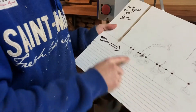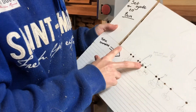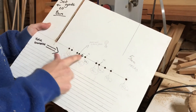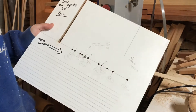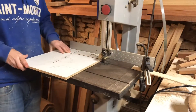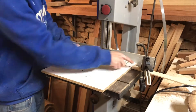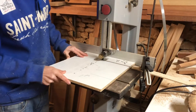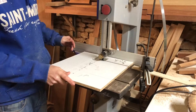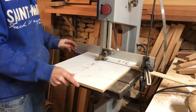Here's the board I was telling you about, with a whole set of different distances. This distance will be your radius, so you double it. For example, I want a 20 centimeter circle, so I've set 10 centimeters from the blade — doubled out, that gives you a 20 centimeter circle. I've got a little clamp on so it can't go back any further, stopping exactly where the blade meets, which will be the center of the diameter.